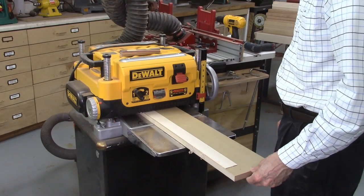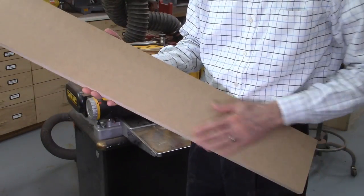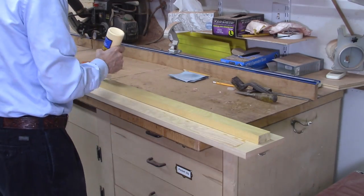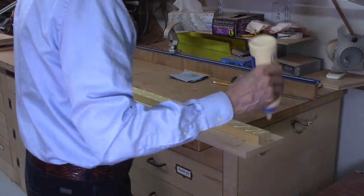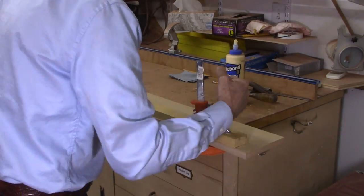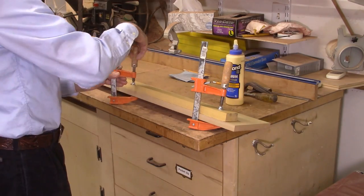You can either run it through your board planer to remove the excess board material on it, or you can leave that little bit of material there and just glue right on top of it, because it already is straight and flat. So as long as you're cutting boards the same size, you can just glue right to it. But I've reused these sacrificial fences, you know, 30, 40 times, just either planing it down or just gluing to the previous board that was on there.